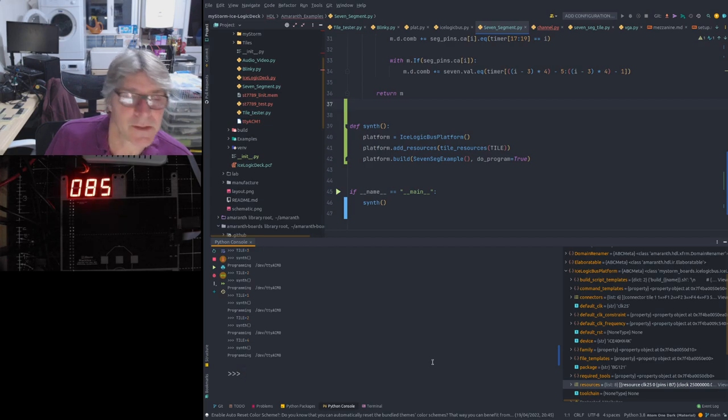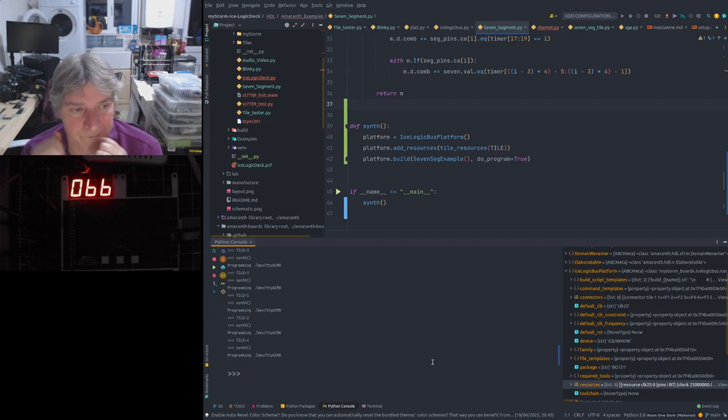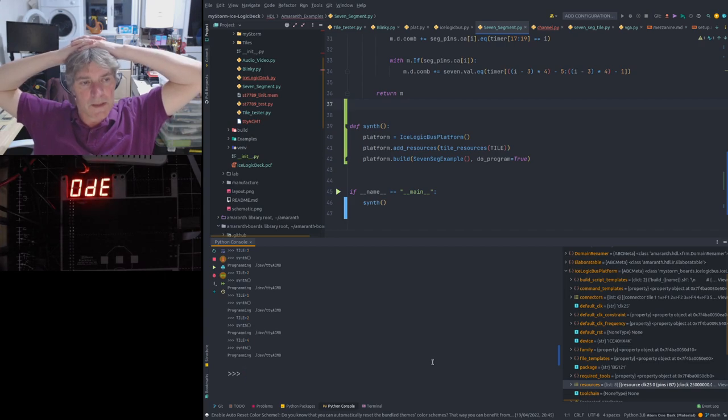We like it. How are we doing for time? Yeah, we're good. So that's good. So what do we know now? All the tiles are working apart from our dodgy number 2, but we know that's just down to the connector. It's not down to the rest of the board. That's just shite reflow. That was the one where it was hanging off, half soldered on. So good. We've got that. We know that SPI works as well.